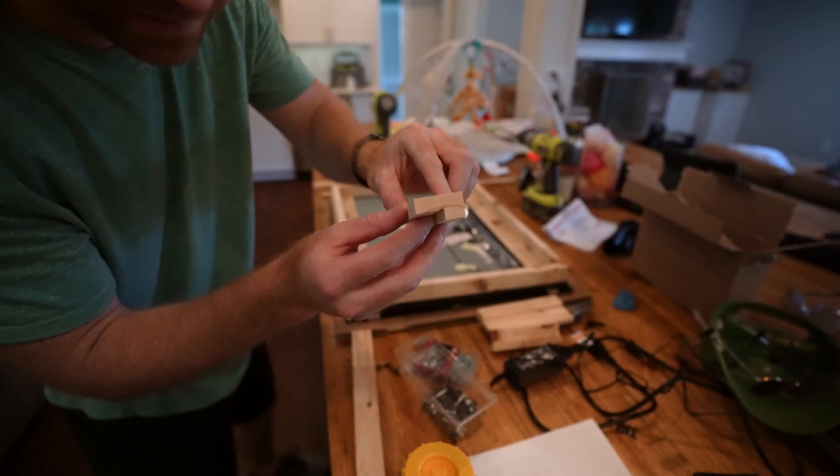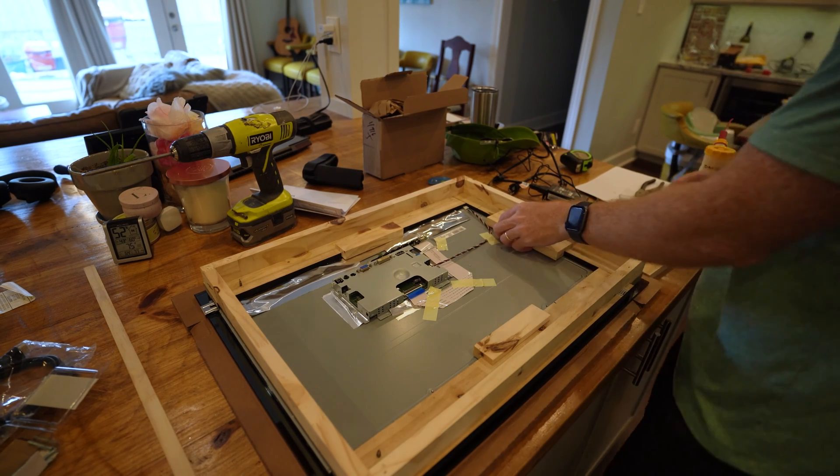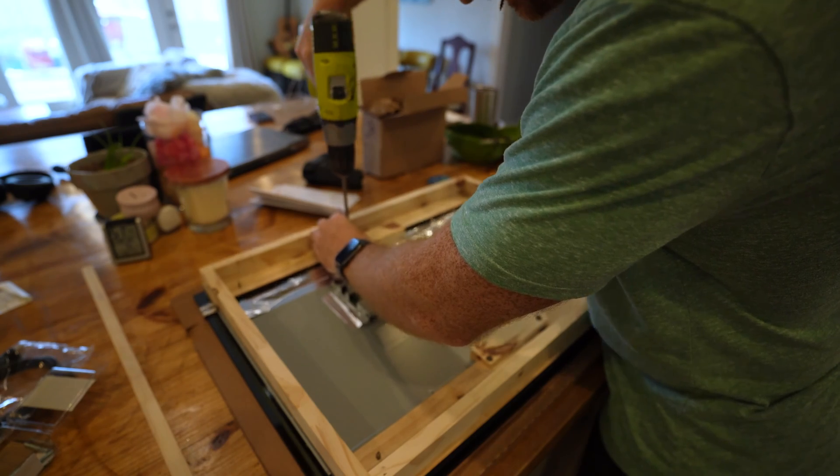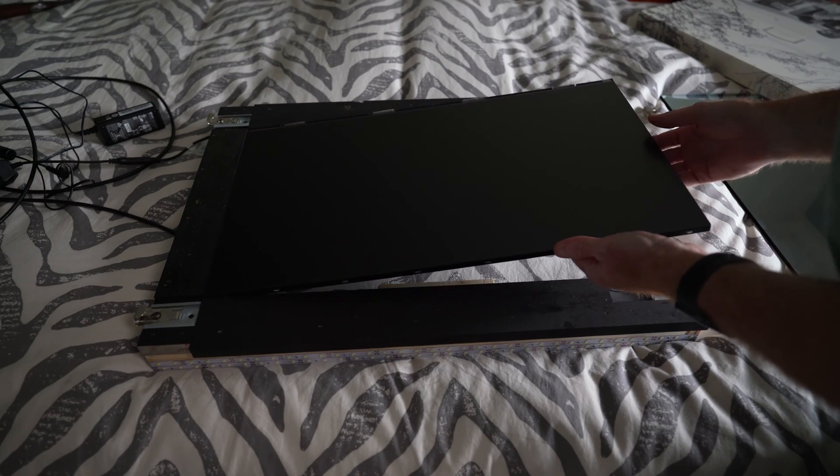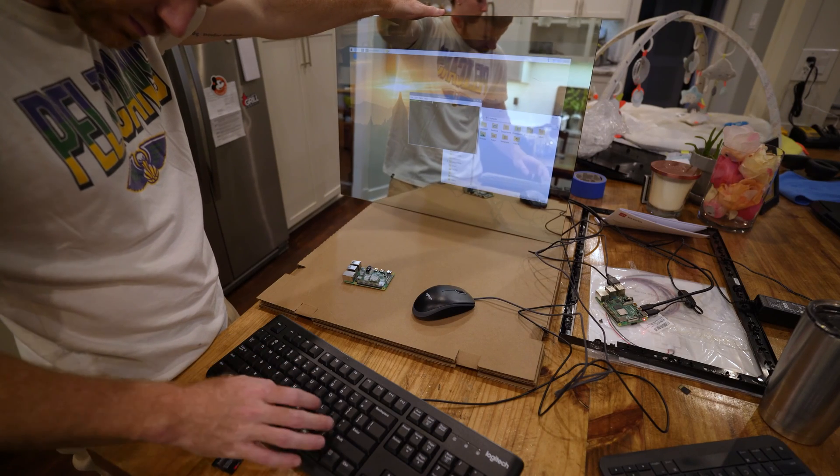The last thing I had to figure out was how to hold the display panel up against the glass. Because of the clamps, I've got a way to hold the wooden frame and the mirror together — but how do I get the display panel to also sit flush? I took three pieces of scrap wood, notched them so they could screw into the frame and hold that back panel in on three sides. My panel is actually in portrait, not landscape — you can do whichever you like by going into the Raspberry Pi settings and selecting portrait or landscape. I'm only supporting it on the bottom and on the right and left sides, so the top is unsupported. You can remove the panel vertically or unscrew those pieces of wood if you need to.